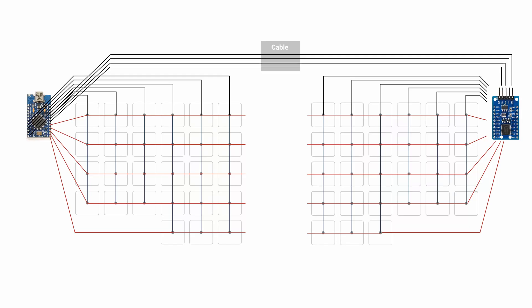You could also use an I/O expander, which just gives you more ports for your microcontroller. These connect over I2C, so you only need two data lines and two power lines, which makes it possible to use any USB or TRRS cable. Like with the previous way, this only works if you connect the main half to the computer, as the other doesn't have any logic in it.